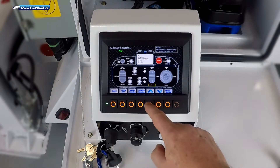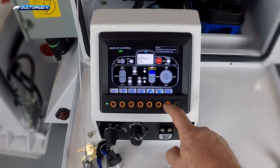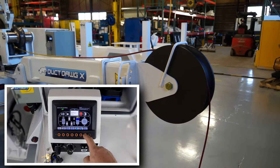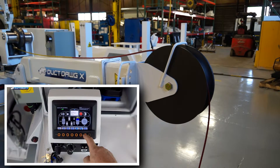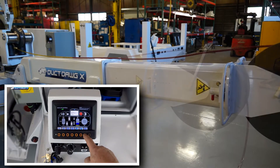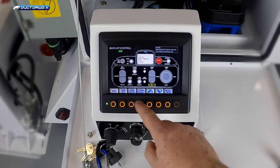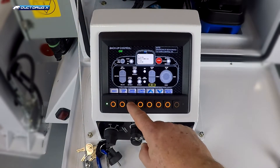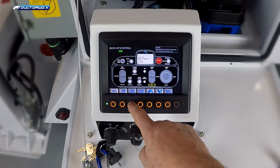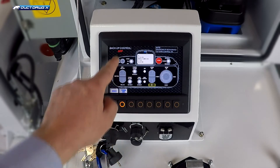In this example, we will extend the boom out and retract the boom back in. Press and hold the select enter button and it will extend that function. Move the yellow highlighting box to boom in, press and hold select enter, and it will retract the boom. You can also raise and lower tension from this screen with the raise and lower tension buttons. When done, you can turn off the backup control.